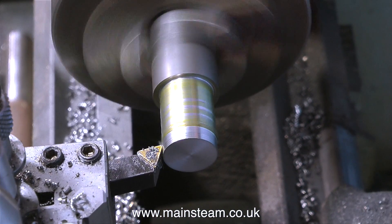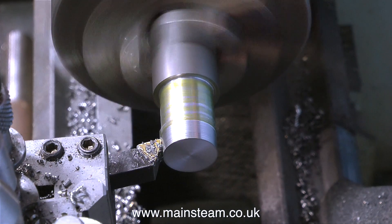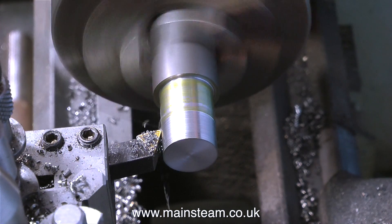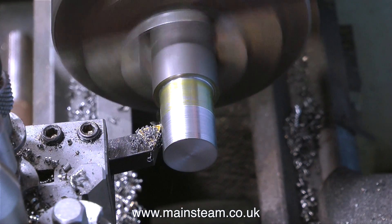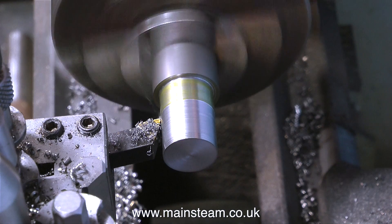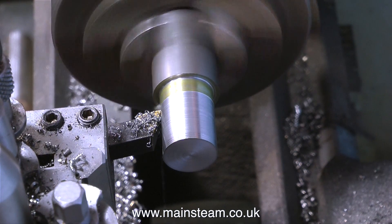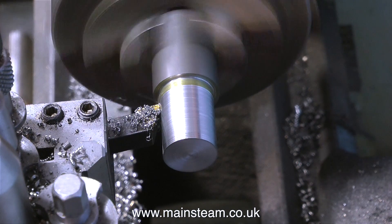Over now to my small Boxford lathe, where I'm making a part that's going to fit in the centre of the four-jaw chuck, which more often than not is screwed onto a fitting attached to my rotary table. I use this four-jaw chuck more frequently on the rotary table than I do on the Boxford lathe it belongs to. The four-jaw chuck screws onto a threaded adapter bolted to the rotary table, and in the centre of this adapter there is a hole. So what I'm doing at the moment is turning this shaft to fit into the centre of this adapter, and then I'm going to drill a quarter-inch hole in the other side of it to take a metal peg. This will give me an accurate centre reference on the four-jaw chuck.